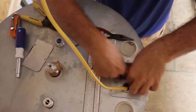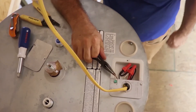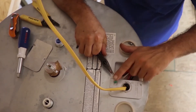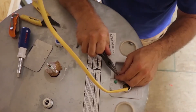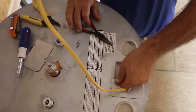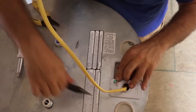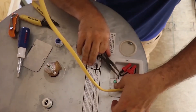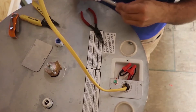Your next step here is to grab this little ground wire — it's going to go under this green screw. That's why it's labeled or colored green — it's your ground screw. There is a little label here, and if you're into reading electrical schematics it will tell you right there. Go ahead, bend it, use your needle nose, and bend a little loop in it. Push it down and under that screw.